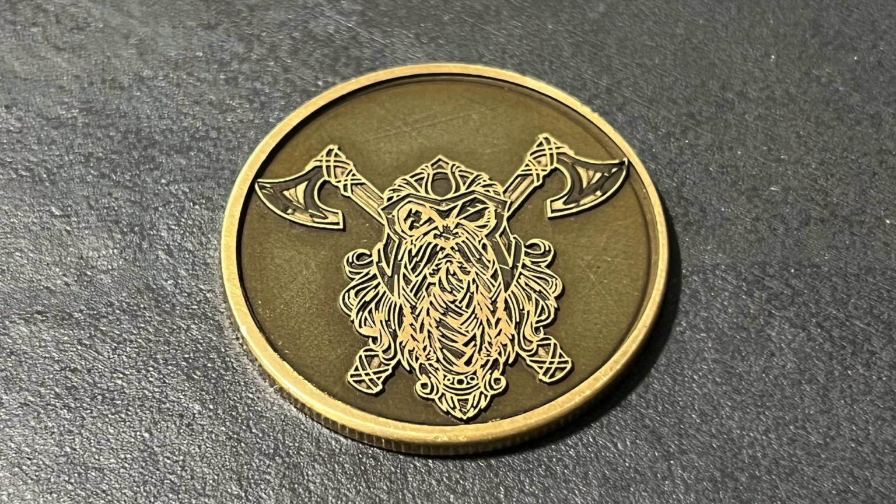Ultimately, it's going to be your decision to go with the one that you like most and the system that you're most comfortable using, whether it be creating the STL and converting it to a height map, or organizing the vectors one by one and overlapping them so that it engraves the correct way. I believe personally, once you get used to that method, it's probably going to be a lot faster. It's not going to take you an extra 2 hours to line the vectors up right after the first couple times that you do it, for sure. So you're going to ultimately be saving time, in my opinion, sticking with the vectorized file.